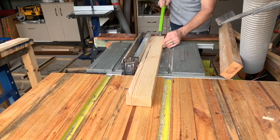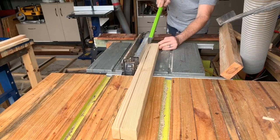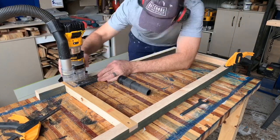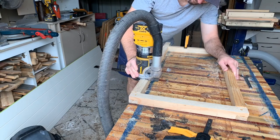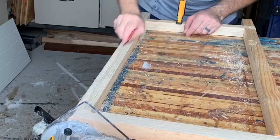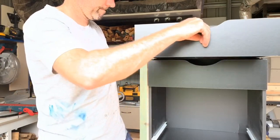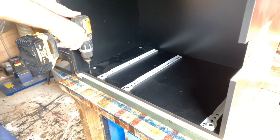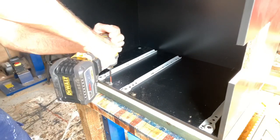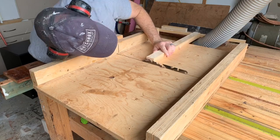With the leftover two stretches - those nice square bits of pine - I'm going to rip those down and they are going to form all my slats for these two shelves. They'll all be the same width, which is perfect, less sanding, and they'll have some nice gluing surfaces so it all goes together nicely. Trim router - I am in love with this thing. What I'm doing here is cutting a very small rebate. Lesson learned from the big bench: when I start to wrap around these ready-made drawers, the drawers actually hit. So I'm just taking away a little bit off each side so when they go up against the drawers, the drawers open and shut nicely. These are the ready-made drawer things - I'm just going to screw them to the framework. It's a quick and easy way to dodge making drawers, because I'm not a fan at all.